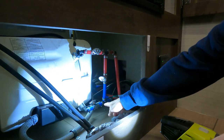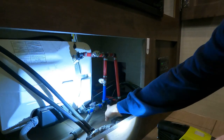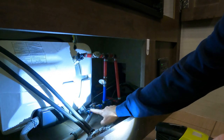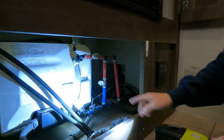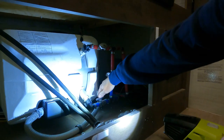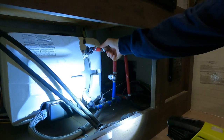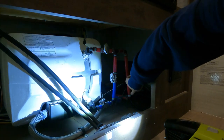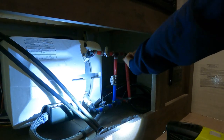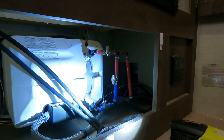There are three valves. As you can see right now it is not bypassed — the water is coming through here into the water heater and then back out. What we want to do is flip them all. We're going to flip this one to turn it off, this one to turn it off, and this one to turn it into the bypass. Now the water will route itself back out without hitting the water heater.